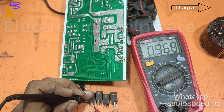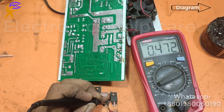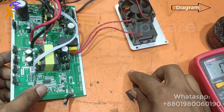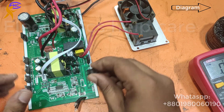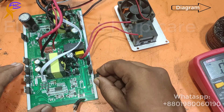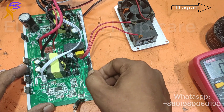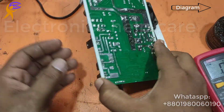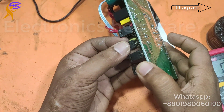Now this is the output MOSFET — 50D, 50D. This is a high voltage MOSFET, minimum 300 volts. Normally a 50D can take 500 volts. These four are okay, so I am going to use these four. This is also an N-channel MOSFET. Both are N-channel MOSFETs, but the output MOSFET can take high voltage. This is 50D. Now I need to solder it with the circuit.